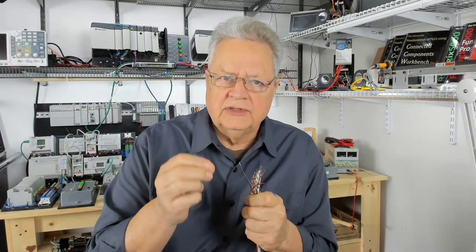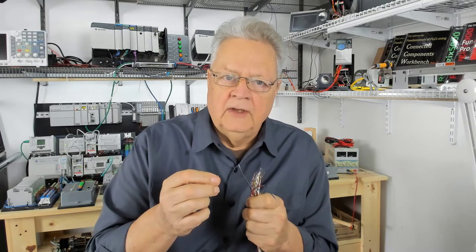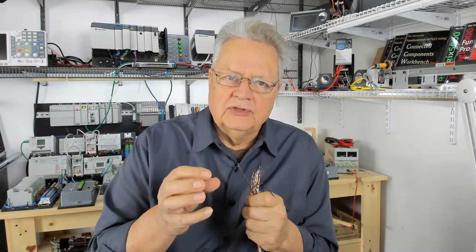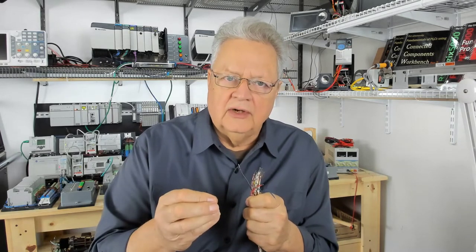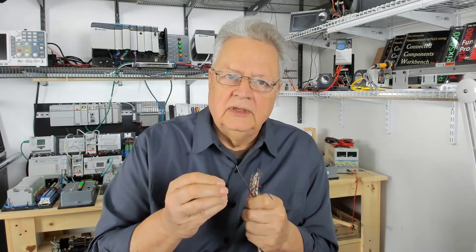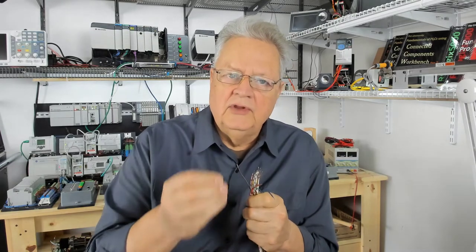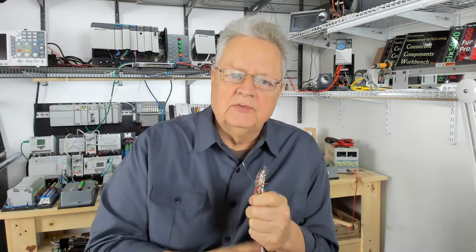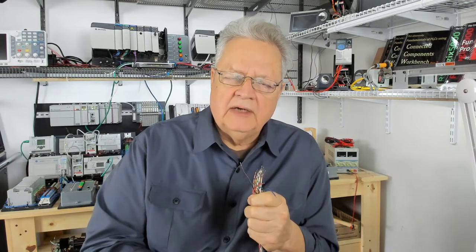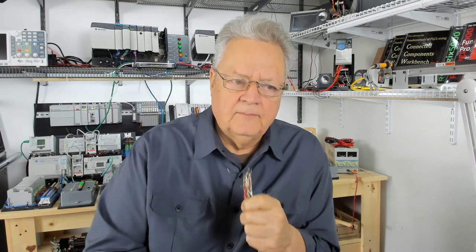that deoxidation, the cleaning of the surfaces, has to take place before the solder can wet the surface. So remember, the rules in soldering are that all of the metal surfaces have to be hot enough to melt the solder. They also have to be clean. So the solder paste increases the speed, once the heat is applied, of cleaning, removing the oxidation, and wetting the surface with solder. So let's move back to the box and start soldering in these conductors one at a time. Let's do this.